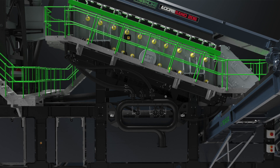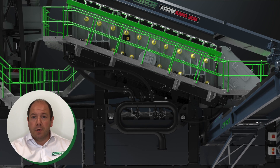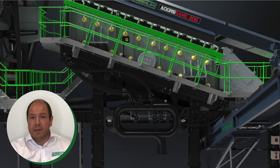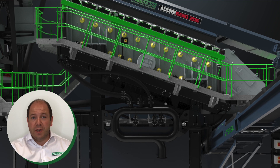This is facilitated by the new onboard ring main. Independent supplies are required from the wash box, screen spray bar system, and the dual tank top ups. This ring main has been specifically designed to manage the distribution of multiple flows from a single water supply. The design has been optimised using CFD software to minimise turbulence and thus minimise pressure losses.